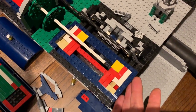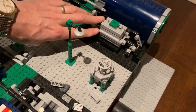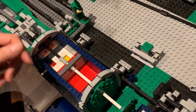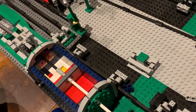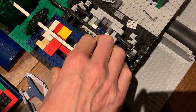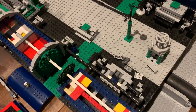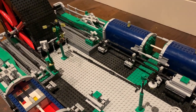That's essentially all there is to it. The most difficult part was getting the Dobson's block working so that the valves pop out at the right time, and the timing of all the valves is managed by the eccentrics. It uses a lot of parts and it's difficult to set up and align — you can get some misalignment between the two cylinders. But other than that there's nothing too difficult to it. If you decide to build something similar, I wish you all the best of luck — please ask me if you've got any questions. Thanks for watching.